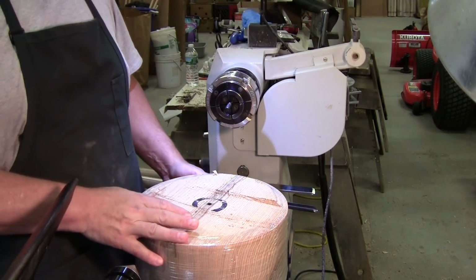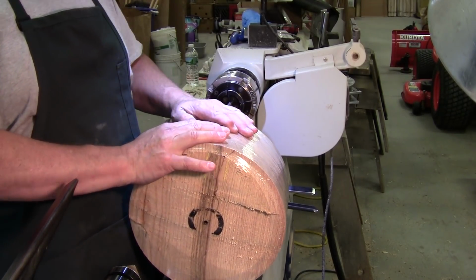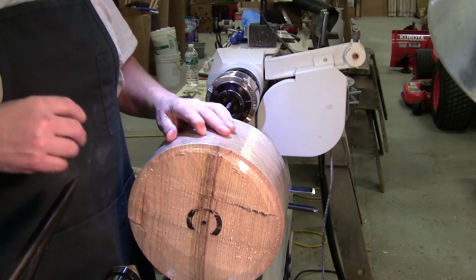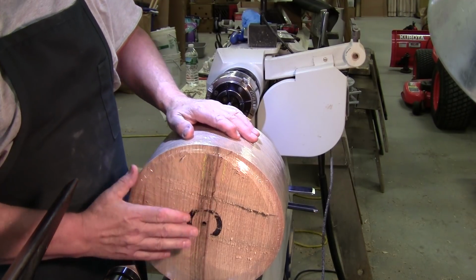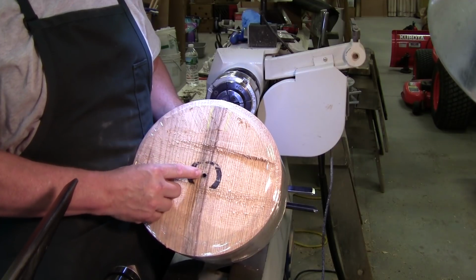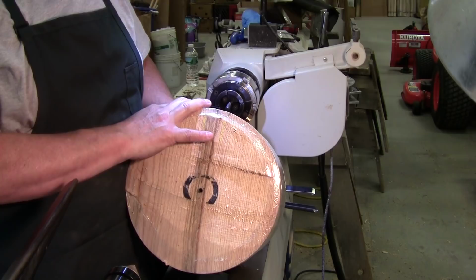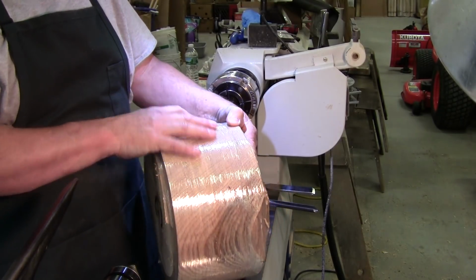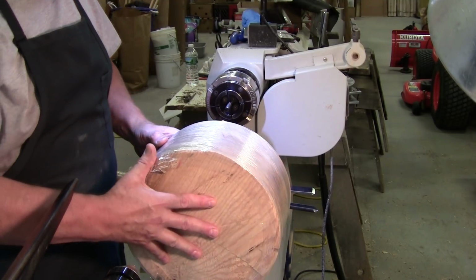Walter at the wood lathe. So, as you might have guessed from the previous video, I am working on a special project of some salvaged wood. Yesterday I made a bunch of blanks, drilled them for the screw chuck, mounted them, and I rough rounded them so I could cover them in plastic shrink wrap overnight to prevent them from drying out.